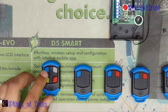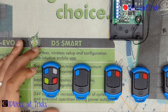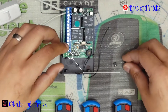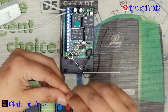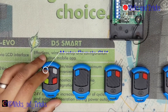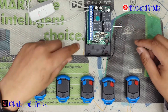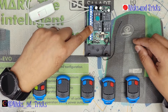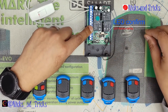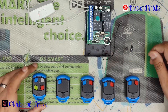Remove your channel jumper. One press latches on, another press latches off. To change it back from latch to pulse, follow the procedure in reverse: power down the receiver, place your jumper on C1 for channel one, place your jumper on the center pin and J2, power on the receiver, press the channel one button for 3 seconds until the LED starts flashing. Pulse is a single flash — wait for a single flash, then remove the jumper. The receiver confirms the setting. Remove your channel one jumper — receiver is back to pulse mode.